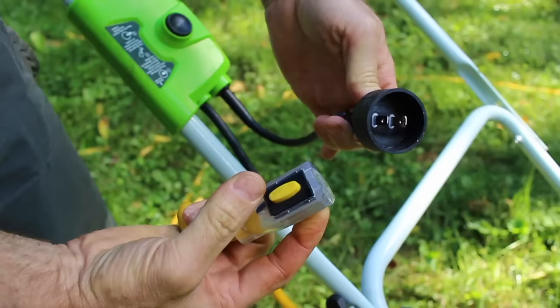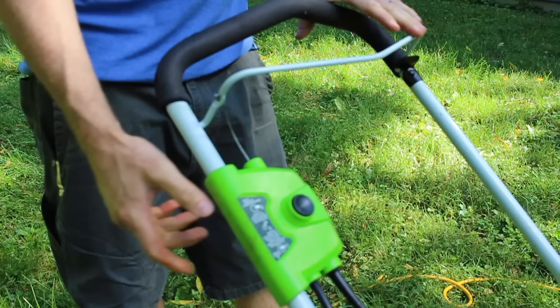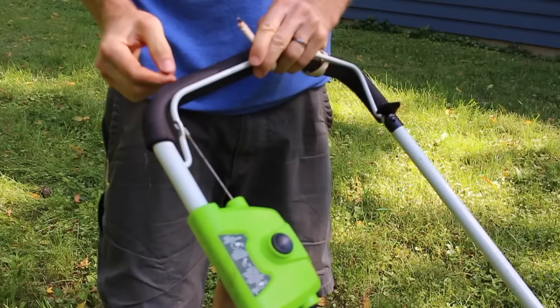If you can find one, get one of these awesome dedicated lawnmower cords. It has a button that links the cord to the mower. And then figure out the starting protocol for your mower. This one has a button you press before you push the handbar. It's an old trick to rig up a wire that holds the safety bar down, keeping the mower running hands-free. I wouldn't do this. It's simply too dangerous.